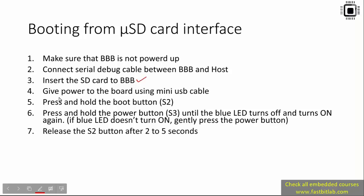After that, insert the SD card into the BeagleBone, and then give power to the board using the mini USB cable. When you give power, what happens is the board boots using the images stored in the eMMC — remember, that's the default boot. Let it boot, no problem.